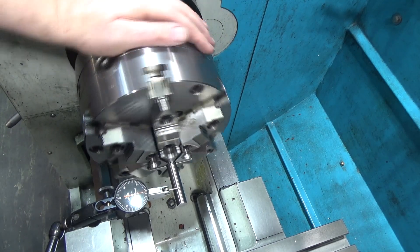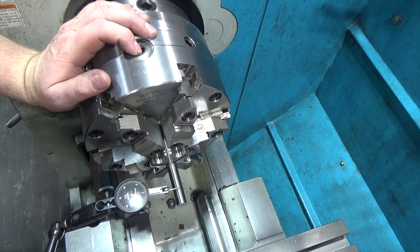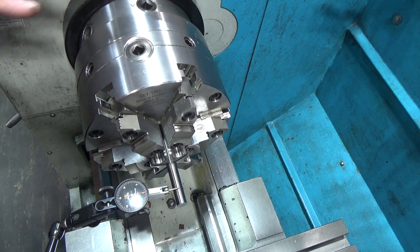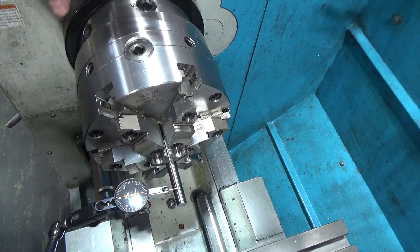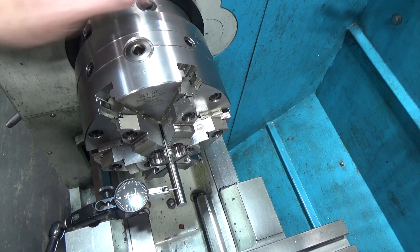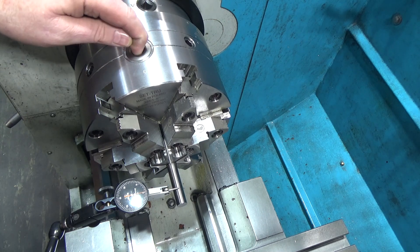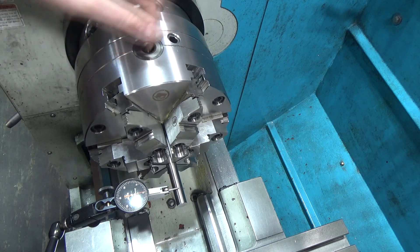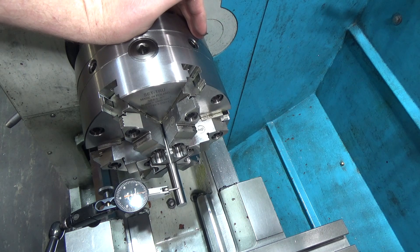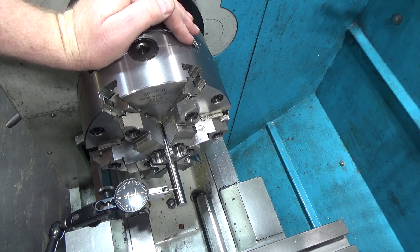To sum up: the master pinion doesn't seem to be better than the other pinions — it's just the one that's identified, maybe a tenth better. What I did discover is that whatever you do to tighten your part, after you tighten and set the set-true, you must repeat the exact same process. If you're walking the pinions, which pinion you start with does not matter. If you're using an individual pinion, you must set your set-true based on that pinion and then always return to it. Thanks for watching — hope to see you next time.